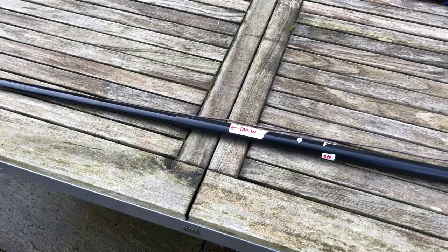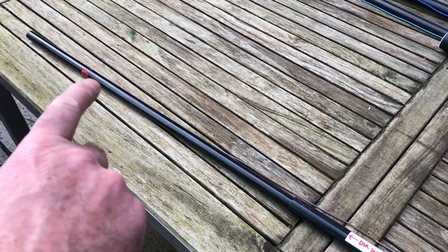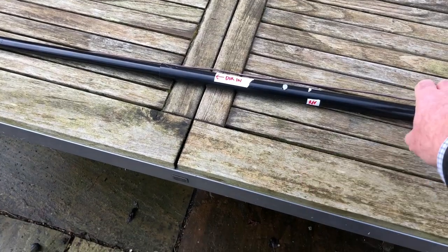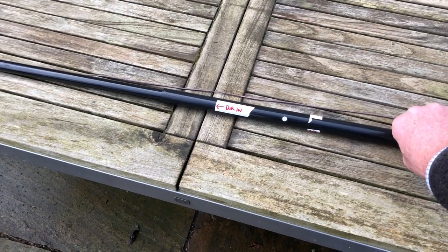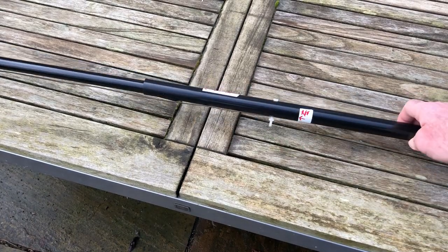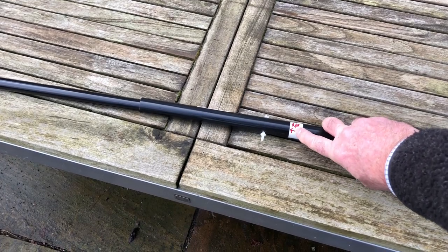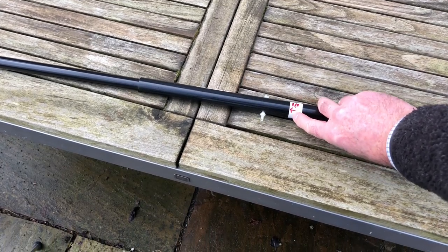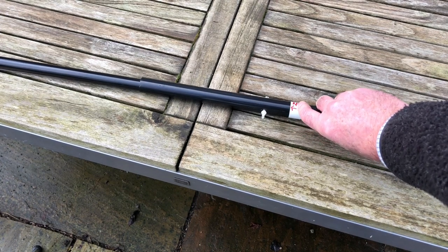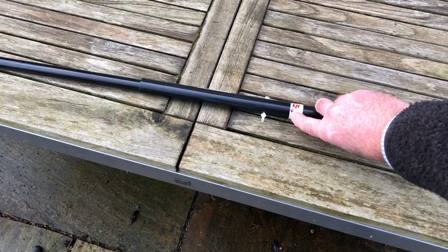And again here, this is the end of the director arm with the loose wire that's just temporarily taped, making sure it's all labelled up. Director in, so that goes through the stub mast. That's the end that goes in first. And you can see here I've marked where the reflector return comes back to. So you'll see this in the build. So this is the other 90 centimeter return, but this one's the loose one. So when I bring the wire back up here, I know that's where I'm going to tape it off.